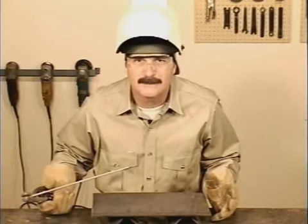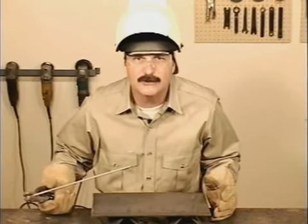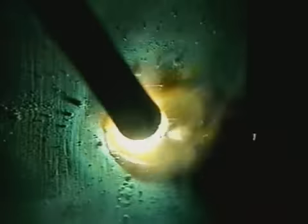With molten slag covering the entire puddle, you depend more on how the puddle acts than how the puddle looks. If the amperage is set too low for the conditions, the puddle won't spread out, taking longer to tie in on the sides. The rod might stick or go out.